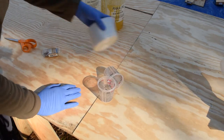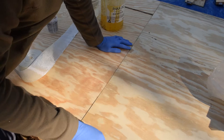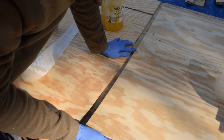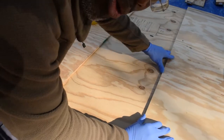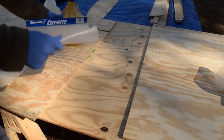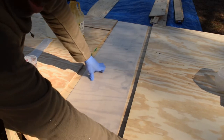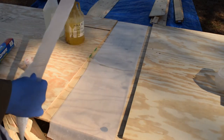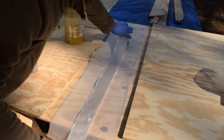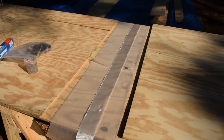We're going to start by butt blocking it. You will need some fiberglass tape — this is three-inch fiberglass tape. We're going to have to do both sides at the same time. We'll move this back, and we're going to need some wax paper. We have four sawhorses, and this thicker piece left over from when we cut out the bow on the transom — that's going to serve as the bridge.